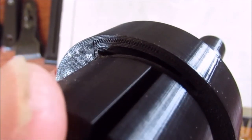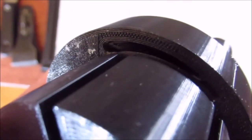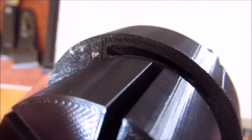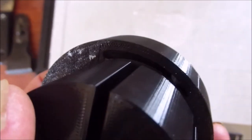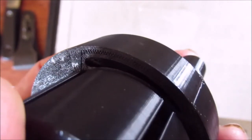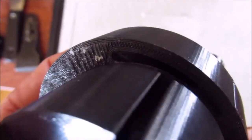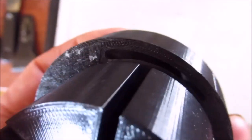And to get maximum efficiency out of a pump, for every revolution you want the same volume going out that's going in. That's important, and that's got nothing to do with a balanced or unbalanced vane pump. But for maximum efficiency of a pump, you want to make sure that, let's say this exhaust port can move, this is just an example, like 1 cubic inch of water per revolution. Well, you want to make sure that you can intake 1 cubic inch of water per revolution.